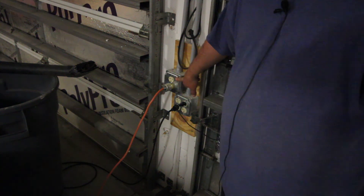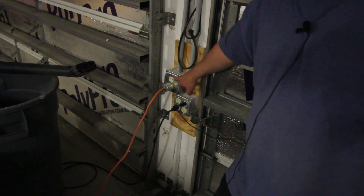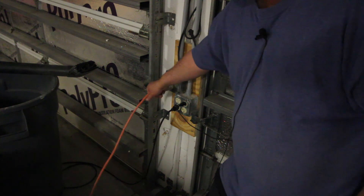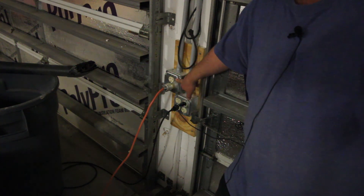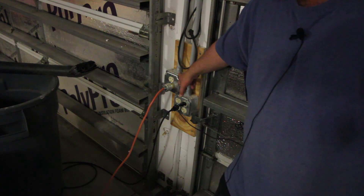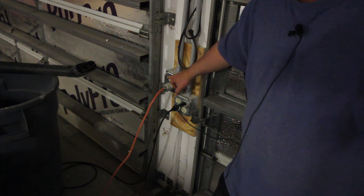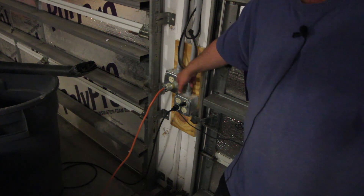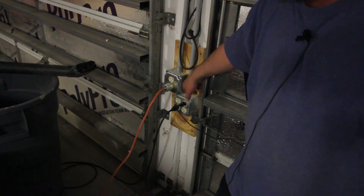This is the 240-volt circuit here. It's a duplex outlet which I actually had to find on Amazon. Right now I've got my table saw plugged into it at 240 volts, and then I've got an expansion outlet here. The metal boxes are grounded. You don't have to use plastic. You can use conduit if it's for protection. And that's how I did it.